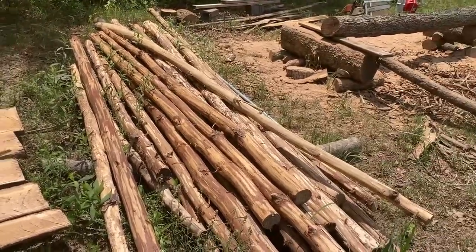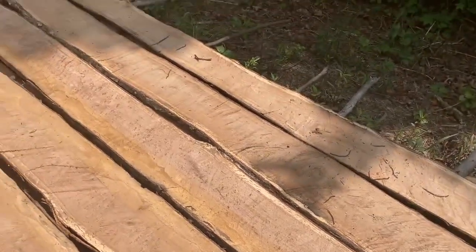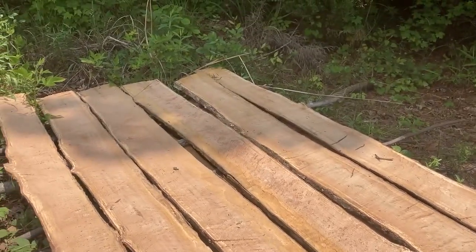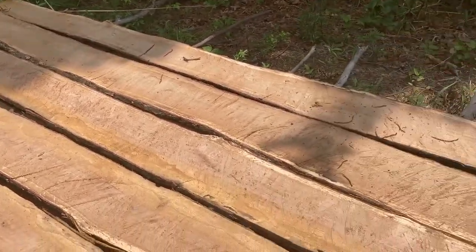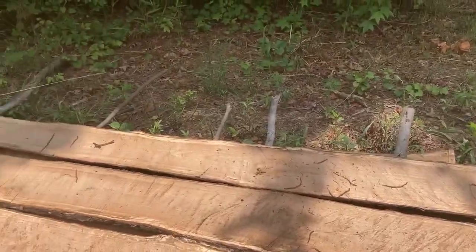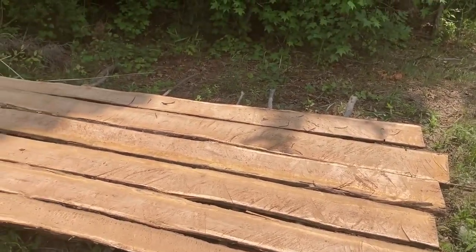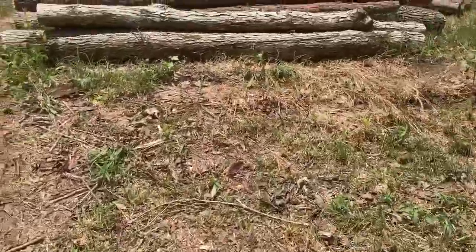I also learned a technique, and you can see it in the saw marks. I'm trying to always keep a point. It cuts and pulls on the saw blade on the saw motor end, and then I pull it back and let it pull itself on the end of the blade on the chain end, so you get this crisscrossing pattern. But when I cut straight across, like those two boards back there, those took about 20 minutes a piece. The rest I did in about 12 minutes a piece, so I saved like 8 minutes by doing that. And my chain is lasting a whole lot longer that way. I think it more mimics a cross cut, which is the kind of chain I got. So anyways, a lesson I learned there.